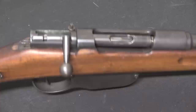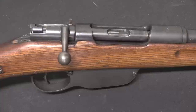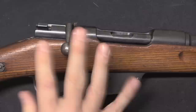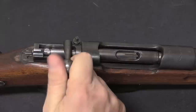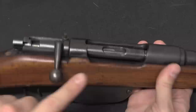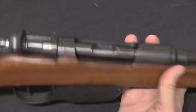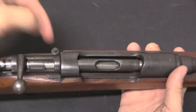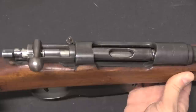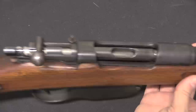So let's take a closer look at how this actually works. The idea, of course, is that you can use your actual service rifle as your training rifle as well — so the cost is reduced, the concussion is reduced, the recoil is reduced, but the handling is essentially the same. Now, that's not quite 100% true for the case of the M95 rifles here. This is a kit that was developed by Irma for the Mauser 98 system, so it is a turn-bolt rifle — it's not a straight pull like the M95 originally was. Irma made some versions of this for the Mausers that actually have 5-round magazines, but this one is just a very simple single-shot mechanism.